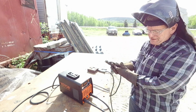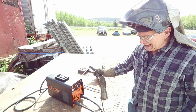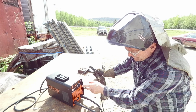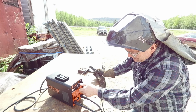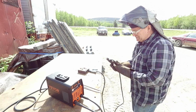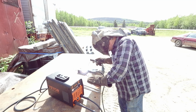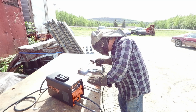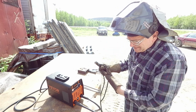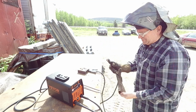It is running better than any of the other little welders I've seen for 1/8 inch, but not great. It was better at first too. It tended to back off a little bit. I'm curious if the computer is not left at the same settings. Okay. Just for kicks, I'm going to turn the hot start down to 0 and see what difference that makes. Not much on my scale of how things happen. Okay, so let's turn the arc force for fun down to 0.